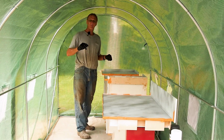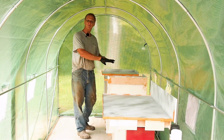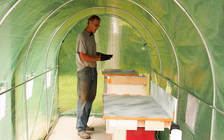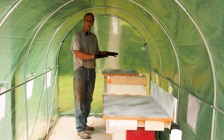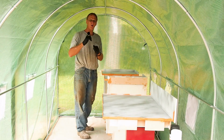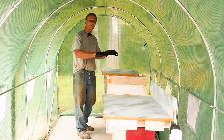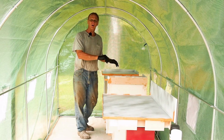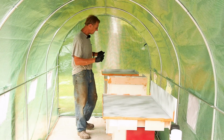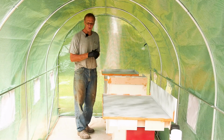A gallon of the epoxy covers 20 square feet. So 15 square feet will be 3 quarts. And I want my epoxy to have a very light look to it when I mix it up. So I'm going to mix up 2 quarts with white epoxy and 1 quart with black epoxy. Mix them together on the surface, get the veining and marbling look of marble on here. That makes very easy math to do when we start using the measuring cups.